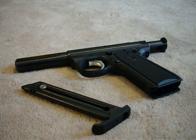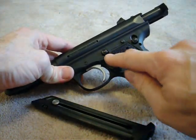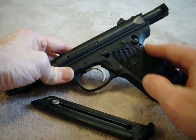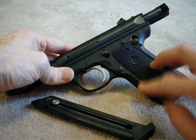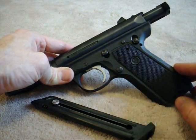One of the more common modifications done to a Ruger Mk3 22/45 is the slingshot mod. On the Ruger Mk3 22/45 there's normally a ball detent that keeps the bolt release either up or down, because when they switched to the polymer grip they no longer had the metal frame to attach a spring, so what they did is they put a ball detent in instead.